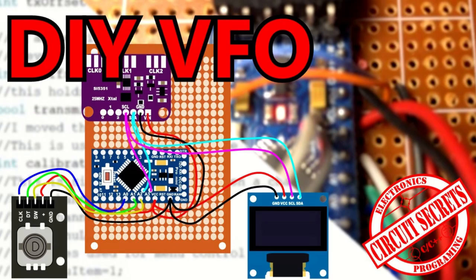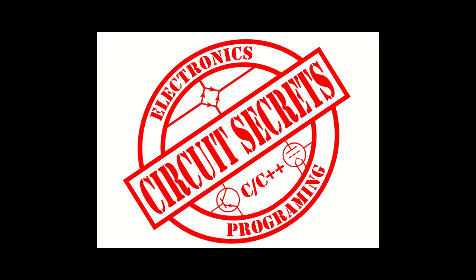Now let's get started installing the VFO I designed in this video into a Cobra 21. You can find the source code for the VFO on my website, circuitsecrets.com. A VFO is a variable frequency oscillator. This VFO uses the SI5351 for direct digital synthesis. So this is a DDS VFO.